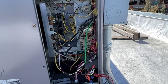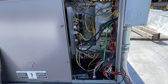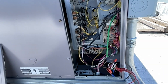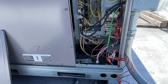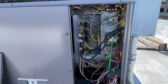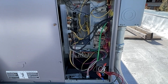So all this started because the thermostat went blank — that's why we got called out here. I got here, found out somebody had turned the main breaker off. Doing my due diligence, I checked the unit, found a bunch of melted stuff, found some nasty filters which we got changed. Checked the contactor, checked the run cap, came back and replaced all the relays, fixed all the wiring, and now it's going good. Just because you find an easy fix, make sure you check the whole unit — this turned into a pretty good repair.